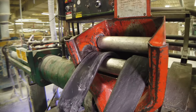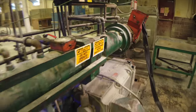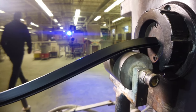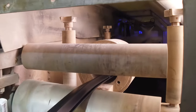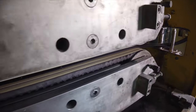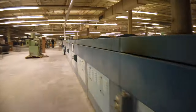It's a matter of taking uncured rubber and feeding it through like your old meat grinders. People are always amazed to find out what our material is like before we extrude it — it feels like a piece of uncured gum rubber. You extrude the profiles with a die on the end in the configuration you're looking for. It goes through a tunnel, passes through a heating unit that cures it in-line to make the proper durometer. In some cases we have cutters on the end — people want pieces cut out of that extrusion, just cut them to fall in a box and you're done.